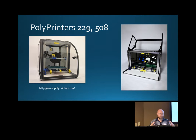Plastic can shrink as it cools — it's very slight — but if you're layering things down and you get a blast of cold air hitting it, it can separate those layers and pull itself apart. With lower temperature plastics like PLA, it's not as big a problem, but with ABS it's much more susceptible to those things. So that kind of enclosed printer can really help with that.